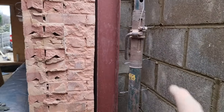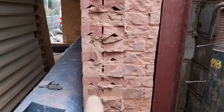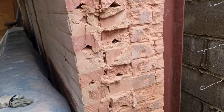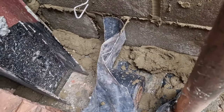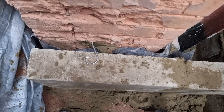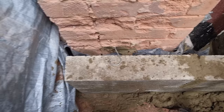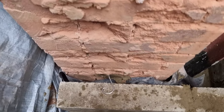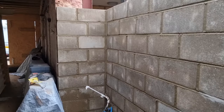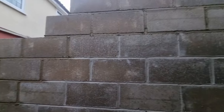There we go — the steel is all encased from the other side. So now I'm going to go from where I put these wall ties out of the wall and into this wall. We've got some wall starter outlets here to use to get into the bed joints, so we'll tie it in double through there. Give it a damp tray — it's already established underneath there. Unroll that, we can butter up outside, and then that steel is completely encased. All the ties in, we've got the outlets in there as well, keeping that nice and secure up there. I brought it just a touch away from the wall because we've got a few scabby bits on here, but that'll keep it sat up there nicely.